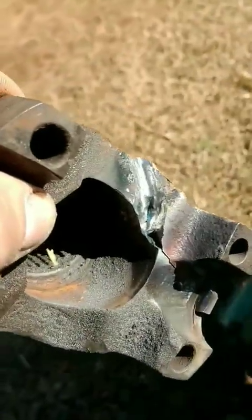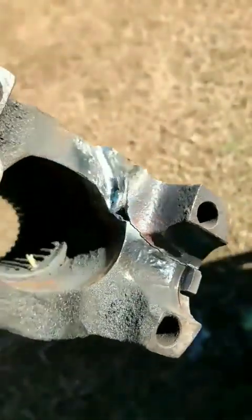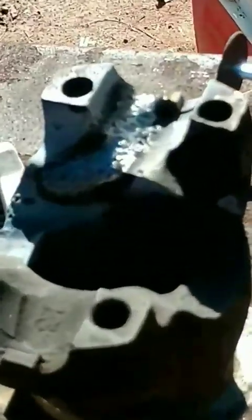The weld has been put in on that one. Then on the back side where you finalize the weld, you want to grind it out till you no longer see the crack. That means you're down to the good metal on the back side again. Then you just fill it up, then you'll go back through on this crack, you'll do the same thing, and you'll fill that. And there you have it, the welded product.